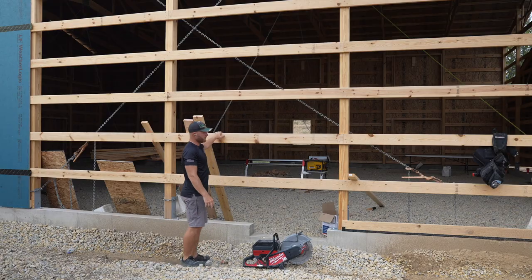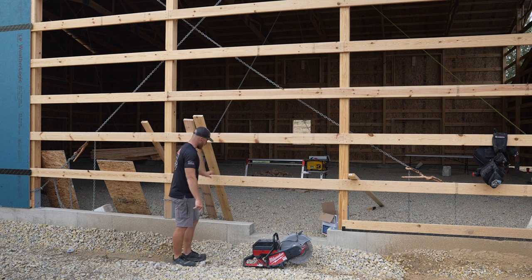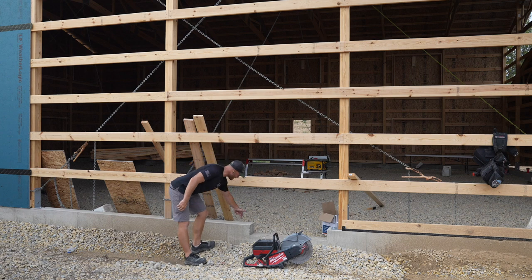We've got to do a little bit of a change. So originally, you can see here where this doorway is. This concrete is in my way. The reason I have to take this concrete out is because the concrete floor that will be going in here is the finished surface. And where that doorway is, we need a nice clean finished surface to go all the way through that doorway, so that when you open your door, you don't look down and see the top of this wall.